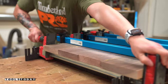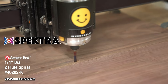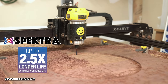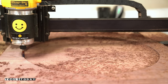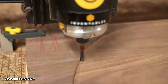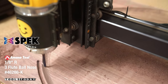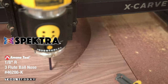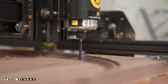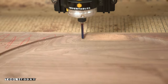After letting the panel sit for a couple of hours, it's time to cut the tabletop at my CNC. I started with the Amana quarter-inch spectra-coated spiral bit and a 3D adaptive clearing toolpath to clear out the bulk of the material and rough out the curvature around the outer edge. Then I swapped to the Amana spectra-coated 1/8-inch radius ball-nose bit and a 3D parallel pass to clear leftover material and smooth out those staircase shapes around the edges, revealing the smooth curvature of the tabletop.